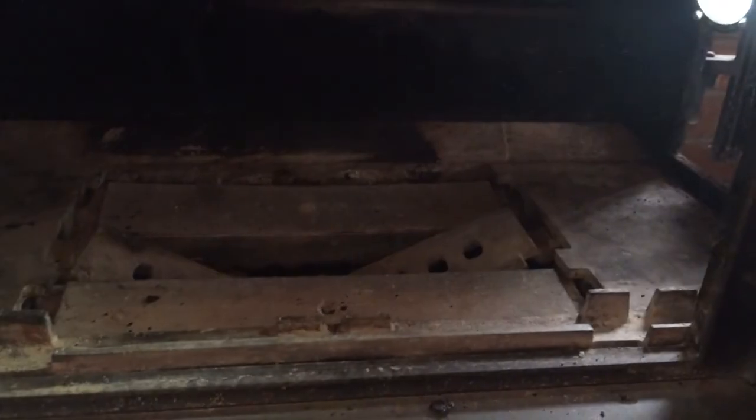Now there's a side plate that also has to come out. It's held in with two eight-millimeter bolts — just a little hex head bolt — but you need a metric socket wrench, eight millimeter, or a box wrench to take it out. Take them out of the top, do the same thing, and lift this plate out. Set that aside.